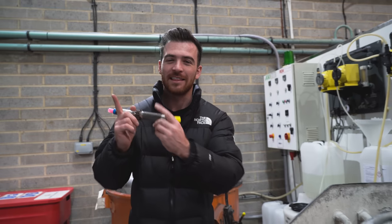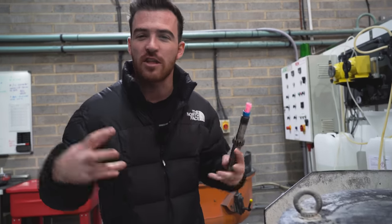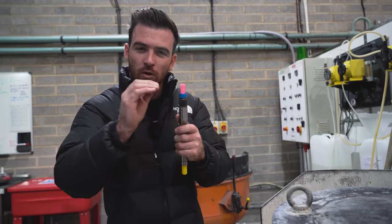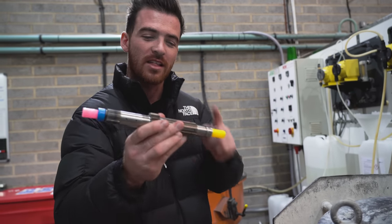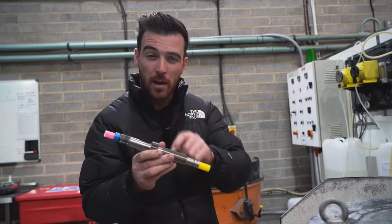While the crankshaft is in that machine polishing, we're going to load all of the gearbox into this machine, which is slightly smaller — same process. We're going to add that chemical in, soften the surface so we can take off all of those peaks and troughs and get it really nice and smooth. This shaft is the one we've been following all the way through the process — the next time you see this it's going to be super shiny and almost mirror finish.